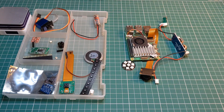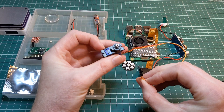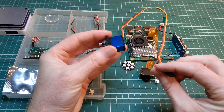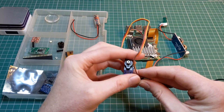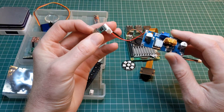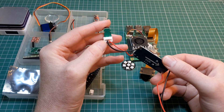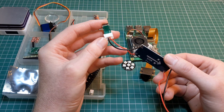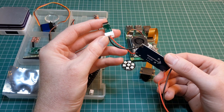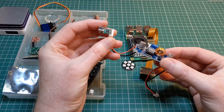There's also a plan to integrate a servo in this version, so the PCB has space for that servo. That should allow for some sort of animation on the head regardless of whether it's connected to the body or neck. The power adapter is also set up so I can add two more wires into the empty sockets, enabling me to connect directly to the power coming from the body. That means I can either accept power through the USB-C adapter or directly from the body when the head is attached.